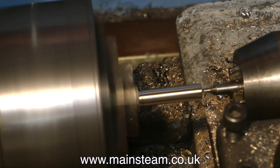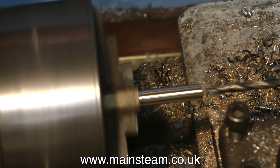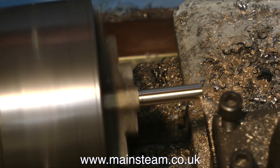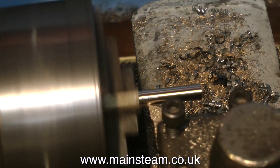I cannot use rigid piping because it's just not going to work. What I have to do is make some adapters for my pipework and use some flexible piping so I can have the engine off the base, connect up the water piping, and then bolt the engine down to the base using the studs that I made in the last episode.